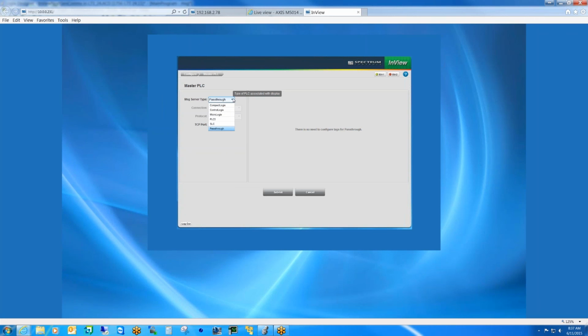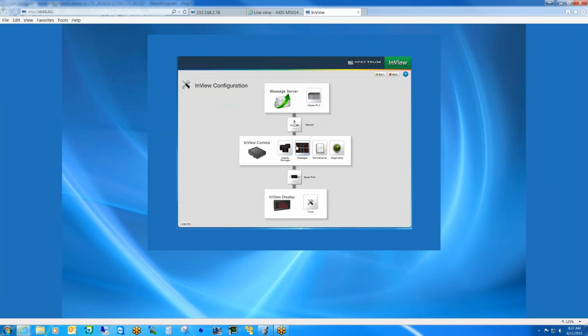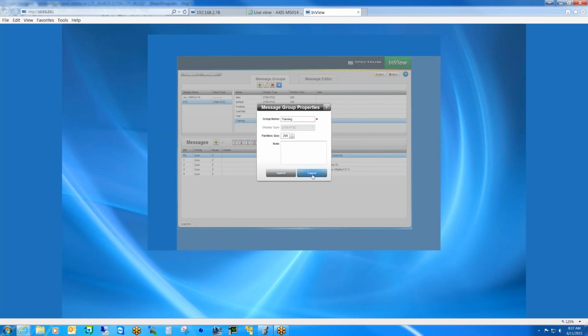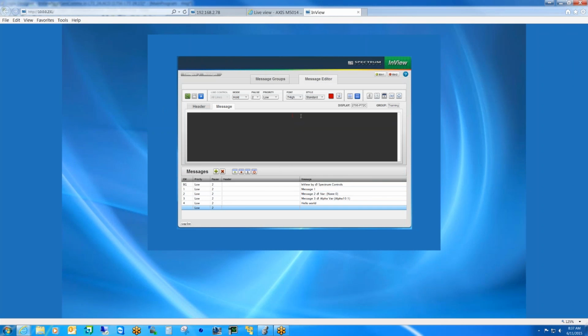What about, and I know I'm bouncing around, but if I had a value, how would I go about setting thresholds if I wanted to, let's say, if the flow rate was above 50 and I wanted that to go red? Can I change that? Yeah, what you would do to accomplish that would be to create one message in one color and create the same message in a different color, and depending on the threshold, you trigger the appropriate message.